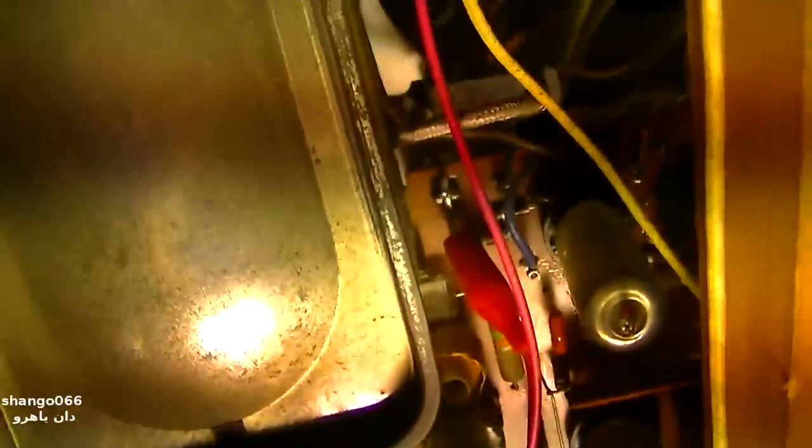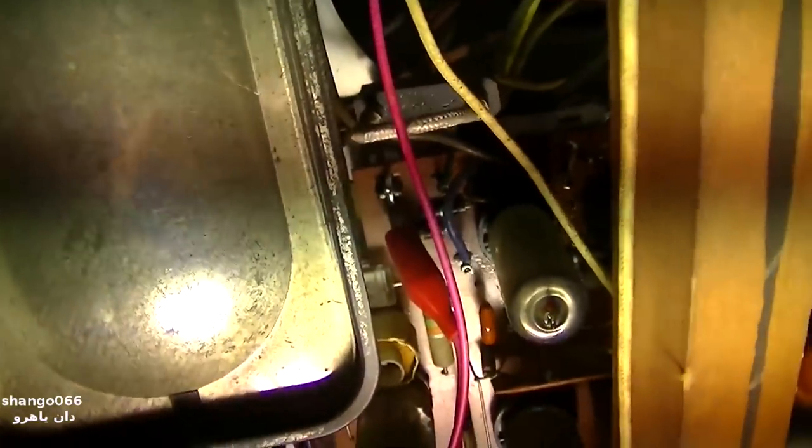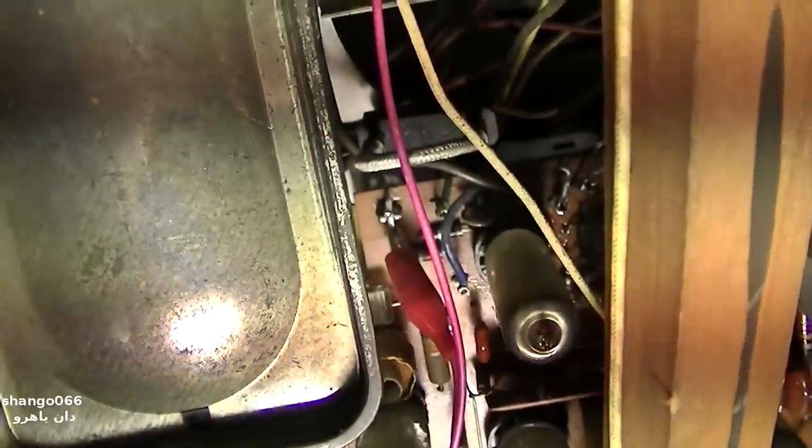The reason why the horizontal output was screwing up initially was because, you can see where the clip lead is there, I don't have that soldered. That ground stake, the solder didn't bite onto the tab, so the ground is floating, but yeah, it's working. And the vertical is rock solid with that disc capacitor in there. I think we're just going to leave that.